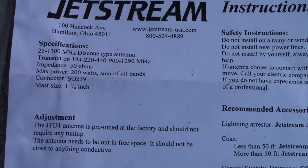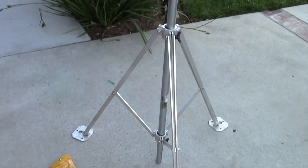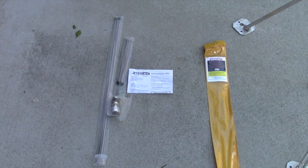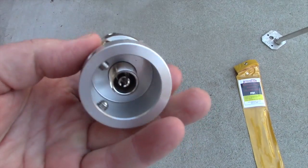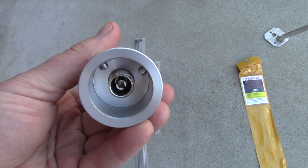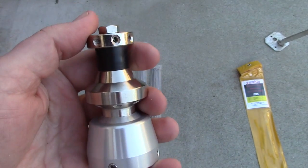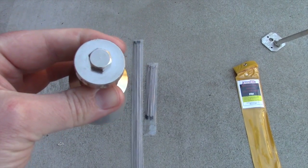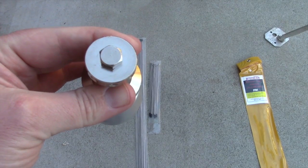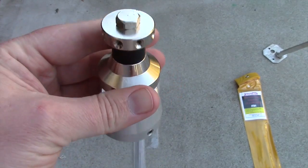Before we go up on the roof, I've got my portable tripod here with a little piece of mast stuck in it — this is where we're going to assemble the antenna. Here's a close-up of the hub: the bottom part is aluminum, you can see the SO239 in there and the allen screws which will tighten to the mast. The top two sections are stainless steel separated by some type of insulator, Delrin or otherwise, and the top bolt that holds the whole thing together is 12 millimeter — of course, because the antenna is made in Taiwan.